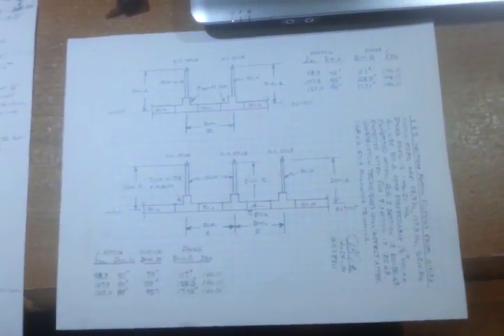Let me show you some of the basic math. A fellow ham friend of mine did some of the basic measurements, and some of it is still French to me. It's not as simple as just getting a couple of T-connectors with coax lengths that are quarter-wave apart and a half-wave center piece — it doesn't work like that. This requires using calculations on Smith charts if you plan on getting this right within a timely matter. You can see his professional writing — he's obviously been doing it significantly longer than me. But I figured it out, and obviously it works.